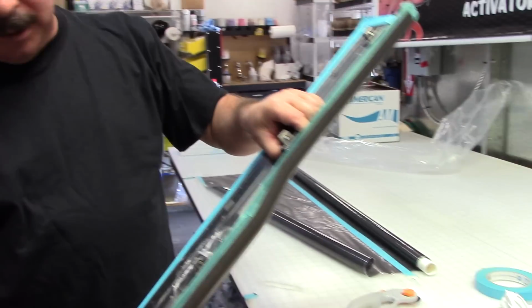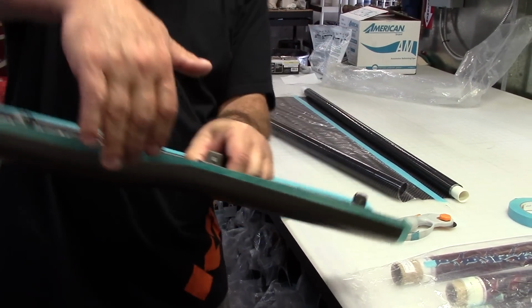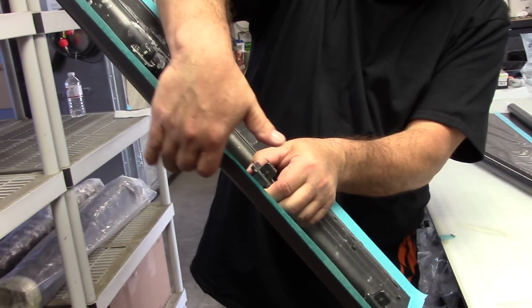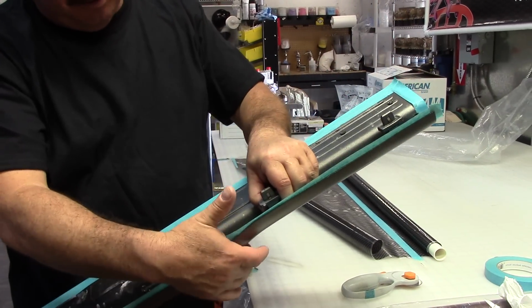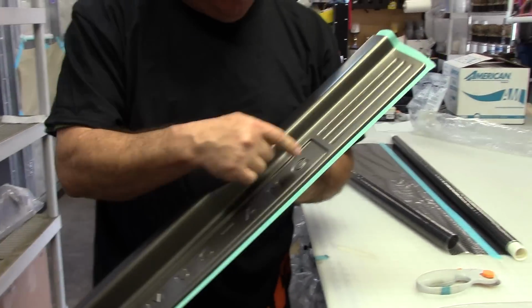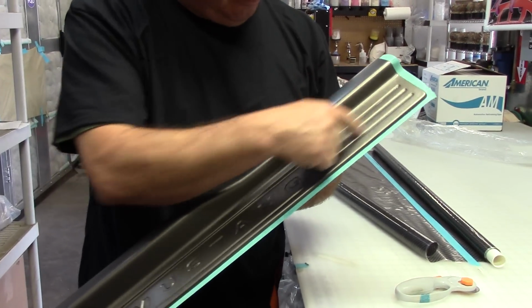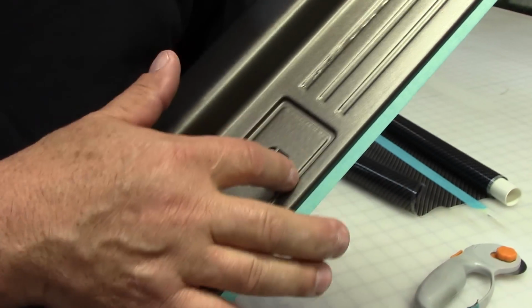When you dip it, there's a couple things with this one. We back taped everything so you won't tear the edges. Secondly, I'm going to go in, not at this angle, but probably at this angle, and probably trap less air, because once you flatten out, you may trap air. Lastly, most importantly, is all the little niches in this thing. All these little things are going to trap air.